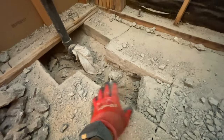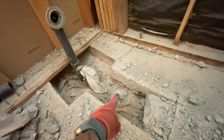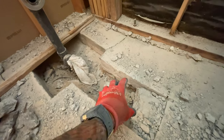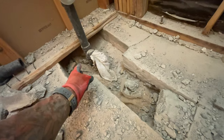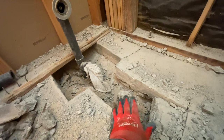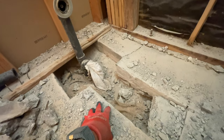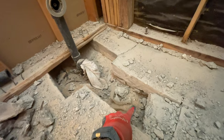Because we don't know exactly how the shower pan is going to sit yet, I'm going to transition from one-and-a-half inch to two inch. The two inch is going to be rising so that we can have our shower drain connect to that. I'm going to leave a little bit of height so we can plug it. There is a P-trap there already so there shouldn't be any gas coming through, but I want to leave a little height so they can trim it and set their shower drain fitting the way they want. Then we'll backfill with some of this dirt and put a little bit of concrete around it.